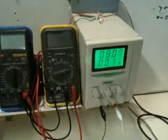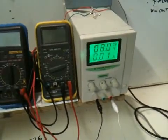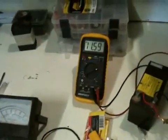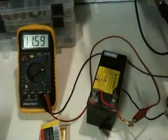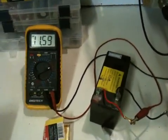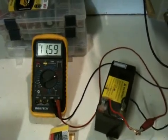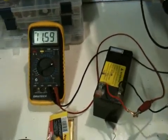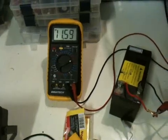That's enabled the voltage to be dropped down to 8 volts, running at 10mA at the moment. The battery — I flattened it out with a spotlight so I could see how well it was charging. I let it sit for a couple of hours and it came up to about 6.8 volts. I've been charging it for about 15 minutes and it's come up quite a bit, seems to be sitting pretty steady there.